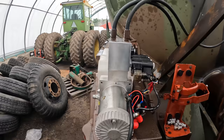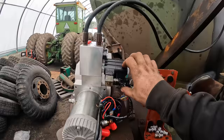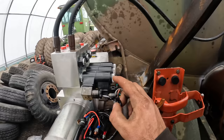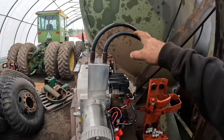I finally went home, and next day I came in and I realized that the outer solenoid - to pull it this way, to apply fluid to this side - was not able to pull it enough when there was fluid pressed against the valve. They had these extra spacers that were between each one, and you put them at the ends. So it did not have enough grab on that solenoid to actually pull it through and open up the valve to allow fluid to go this way.